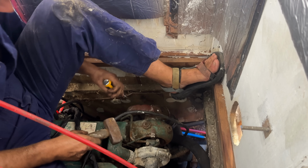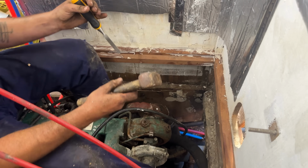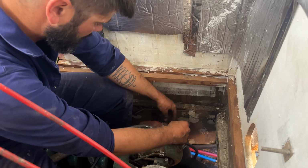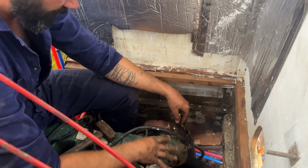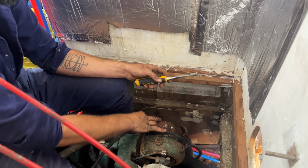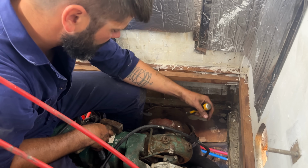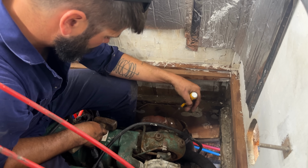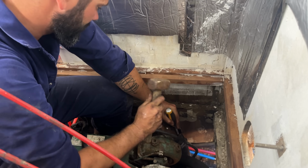If I've learned anything from Sandy Hose, it's take no prisoners. Kill, kill, kill. The iron elbow. These things are known for going in almost every marine diesel engine. That makes sense, because everything up to this point is all just diesel and coolant and stuff, and this is where the salt water returns into the system. This is supposed to be a double-walled jacket where the hot exhaust is inside, and then the salt water hits all the outside, but of course you warm up salt water and it corrodes steel twice as fast.